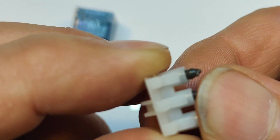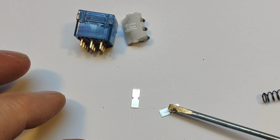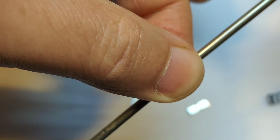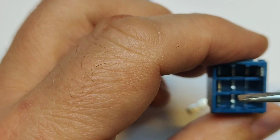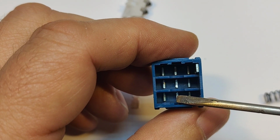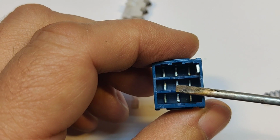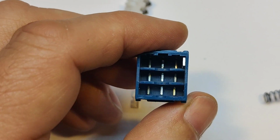is like a soft, again, spring loaded. So this basically rocks over and pushes these contacts down on a rocker. It makes contact that way, then makes contact that way, and that way. And there's three of those basically just rocking backwards and forwards on those contacts there. So you see that center line is the common contact, and then it rocks forward, makes contact with these three. You press it again, it rocks the other way and makes contact with those. That's as good a description as I can do.